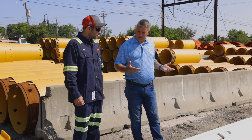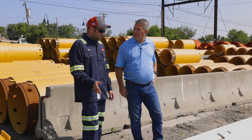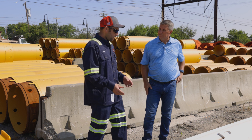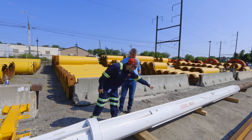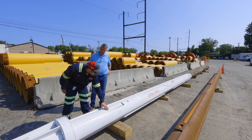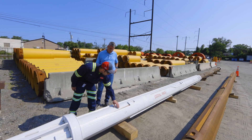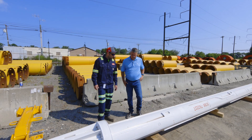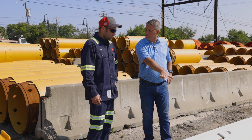We're here at this Kelly bar. This is the outer stage of the Kelly bar, which the KDK would drive on. The KDK, once in place, will slide up to the main neutral lock zone, then slide over into the locking zone. When driving, it drives between this zone and pushes down on this lock for crowding down and drilling purposes. This is what the drive shells inside the KDK lock up against.